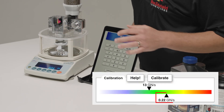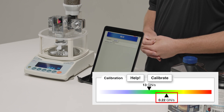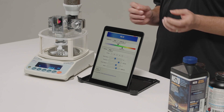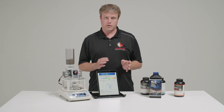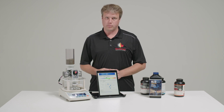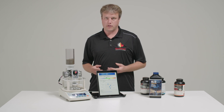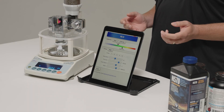The calibration finished. For this one, we have a measured flow rate of 0.22. That's maybe a little bit high, but pretty close to 0.2, so I think we'll just go with it. These kernels weigh around 0.03 to 0.035 grains. Typically we would want to accept plus or minus 0.02, or maybe plus or minus 0.04, depending on how precise you need to be. We're willing to accept some tolerance when using a larger kernel powder like this. So I'm going to set a target of 40 grains with the settings we have and see what happens.